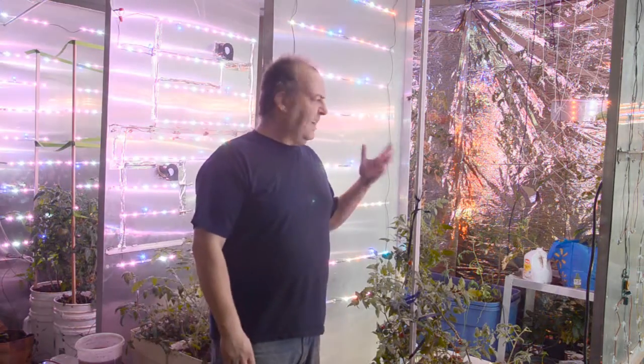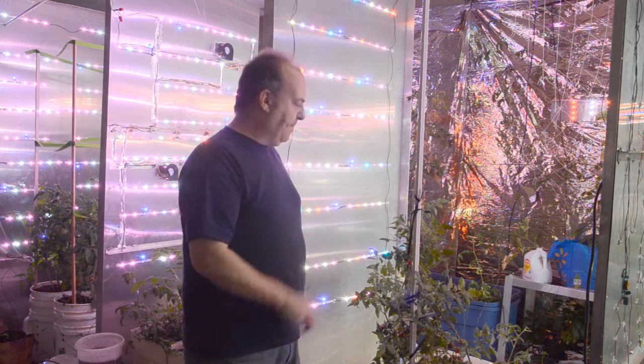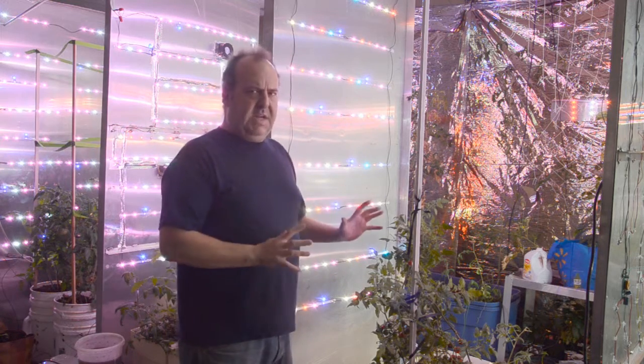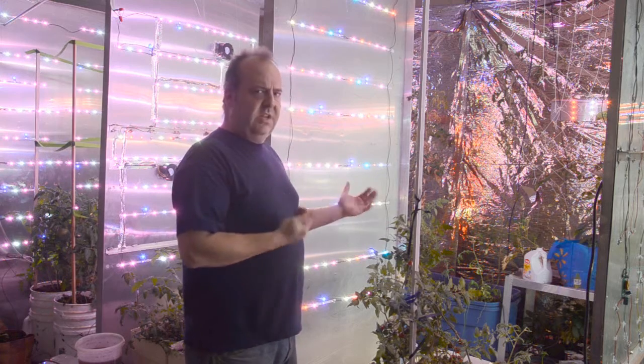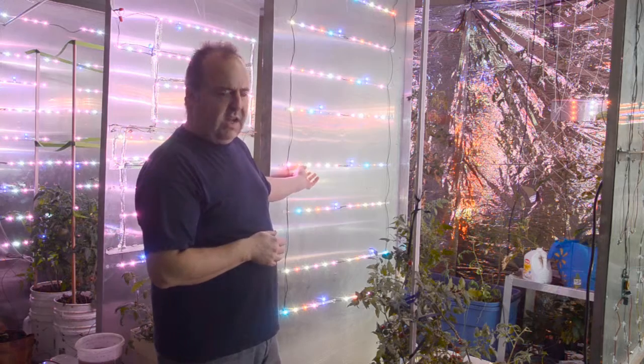Today I'm very excited because I have my third section, my third 500 watt lamp set up. This is a little different than the others because I changed power supplies, so I can only use 11 LEDs per cluster versus 12 LEDs per cluster. So the series cluster only has 11 LEDs.